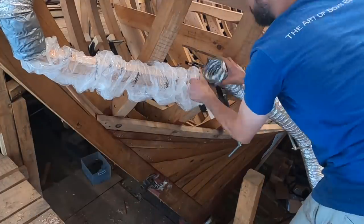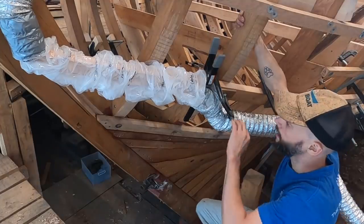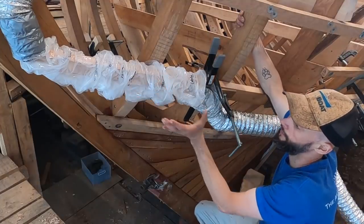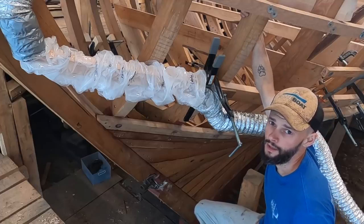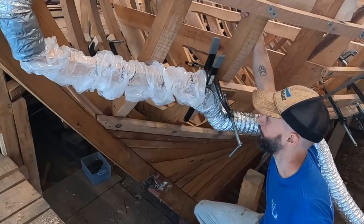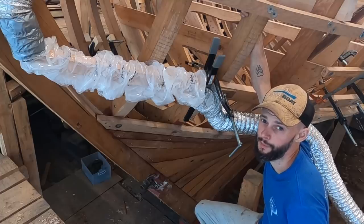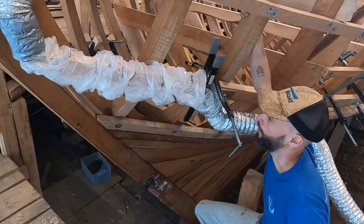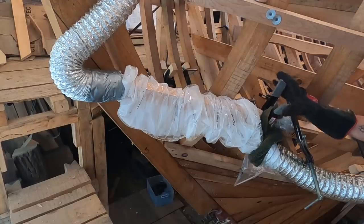So I'm gonna steam the very, very end of this again. It bent in pretty nicely, but I got back here and felt like standing it up into the stern post, I was fighting it too much. And the cedar really is a very temperamental beast, so I wanna be careful with it. Definitely learned our lesson about snapping planks off, putting them into the stern here, and we don't wanna repeat that performance. Okie dokie, I'll try this again.